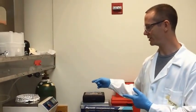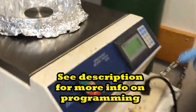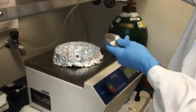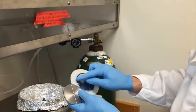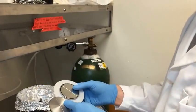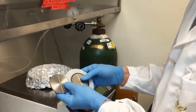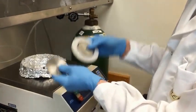That's what we're going to set on this machine — you can watch my fingers to see how to program it. Once the spin coater is set to the right settings, we'll choose the right chuck. We have two chucks: one is usually on the machine, one is usually on the plenum. One has a rubber O-ring that, when vacuum is applied, pulls your wafer to the chuck. The one with the O-ring is better for securing your wafer at higher RPMs. The one without the O-ring I generally use up to about 1500–2000 RPM. For our needs, we only need this one.